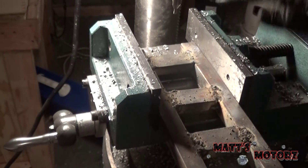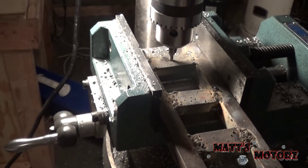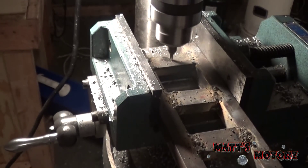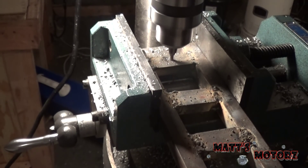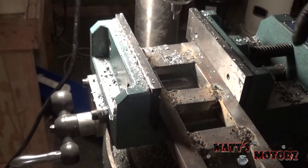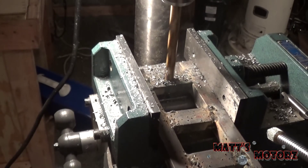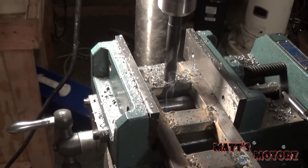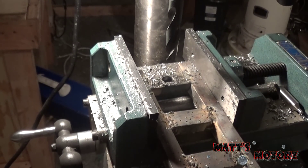We're upstairs and ready to drill these holes. I've got a center drill — it doesn't have to be perfect — we're just going to start the hole on each side, then drill through with a bit slightly larger than half an inch so I have a little play. I got a 5/8" drill bit. Now I'm going to do the same thing to the other side off camera.